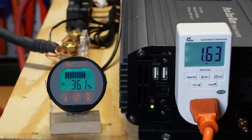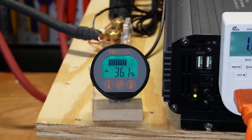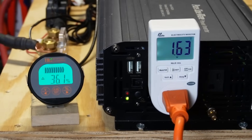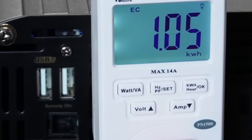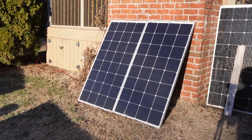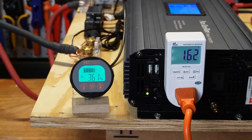It's day three. As I mentioned, I did bring the battery state of charge down to 35%. The panels are just starting to get some sun and they've brought it up to 36%. We have used 1.05 kilowatt hours across the last two days in the entire experiment. We now have two panels out there wired in series, so I feel pretty confident they will bring the battery state of charge up to 100% today as long as we get good sun, and I believe we will according to the forecast.